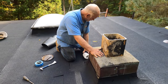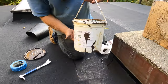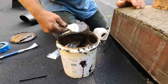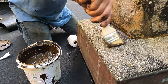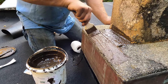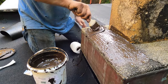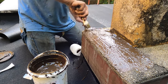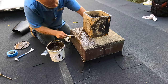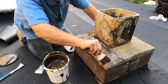The best way to take care of it is very simple — you use turbo poly seal. This is what I use and it lasts forever. What you do is smear this on right in the corner — it's gooey stuff, very gooey — and you smear that on. You go around about an inch over this edge where the transition is, like that.